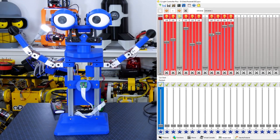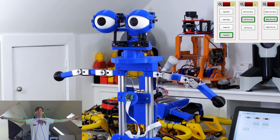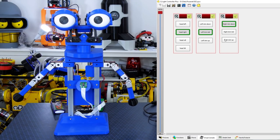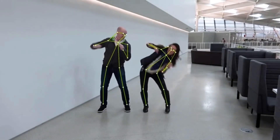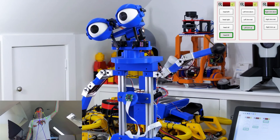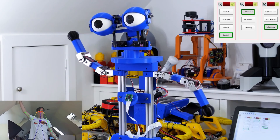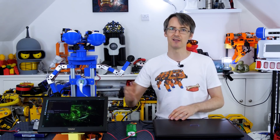The software also gives him a ton of opportunity to smooth out the animation for the robot so it doesn't have that telltale jerky servo motion. More importantly, he's able to use it as an abstraction layer between the computer vision control and the robotic output. Because the Raspberry Pi camera has no ability to determine depth, the data created by PoseNet is strictly two dimensional, which is why the robot's motions all happen in a flat plane. Still, it's a really fun interaction to make the robot dance or wave and see your own motions reflected in the robot's body. James provides all the code used to control the robot, as well as all the CAD files free to print your own.